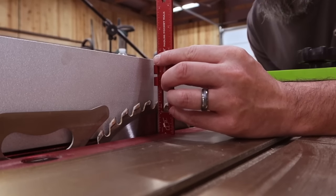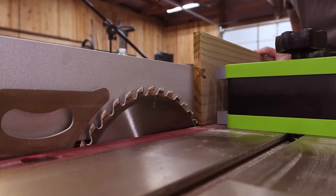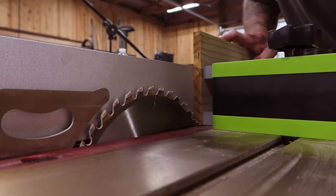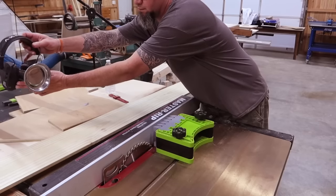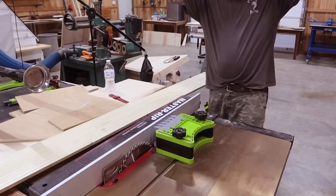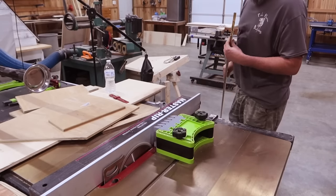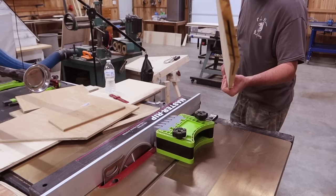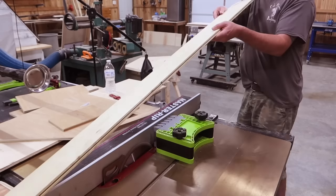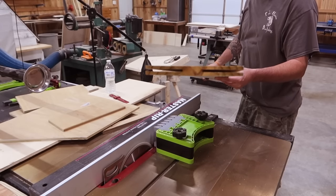Now for the shingles. The shingles can be made several different ways — I'm going to show you a way to do it on the table saw. You can do this on a band saw by cutting your material in half into quarter inch sections, or if you're not comfortable with either, you can just buy quarter inch plywood. I've set my blade height at two and a quarter and my depth at one quarter. Try to pick out the closest picket you have to five eighths. Since I'll be cutting these boards vertical, I'm going to be using a feather board. By cutting it this way before ripping it, it will still give you an inch of material in the middle, which eliminates any risk of kickback. I'll make this cut to both edges of this board and then we're ready to rip it down.